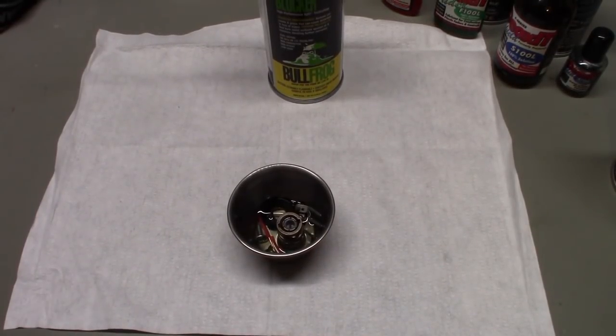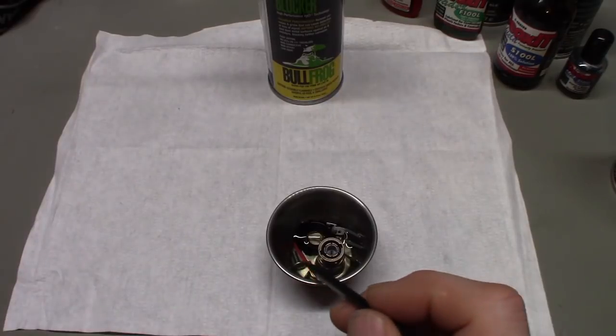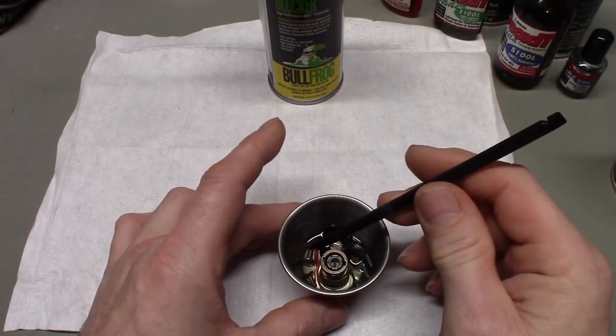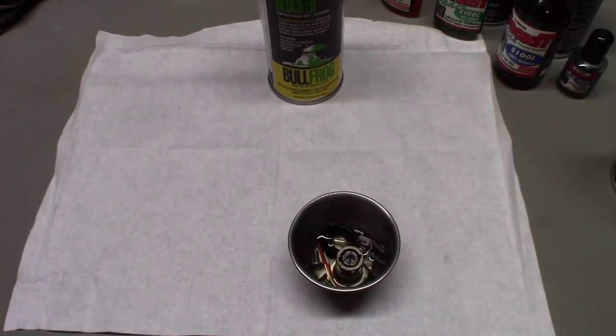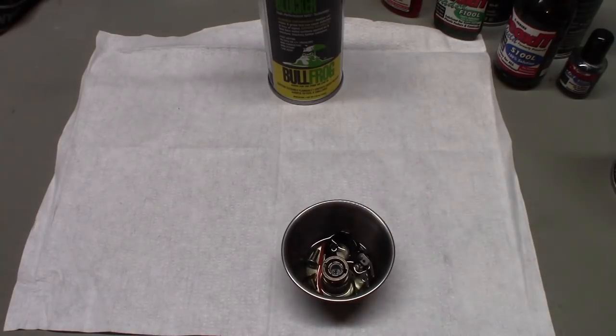One quick addition — since we're doing a torture test, I might as well throw in a few more things to see what happens. I've added two pieces of wire: a piece of stranded tin-plated wire and a piece of solid unplated copper wire. I also dropped in a nickel-plated screw and a phosphate-plated screw. Just curious to see what it does to all of these metals if anything — ideally nothing — but I wanted to add a few extra items to get a better long-term picture.